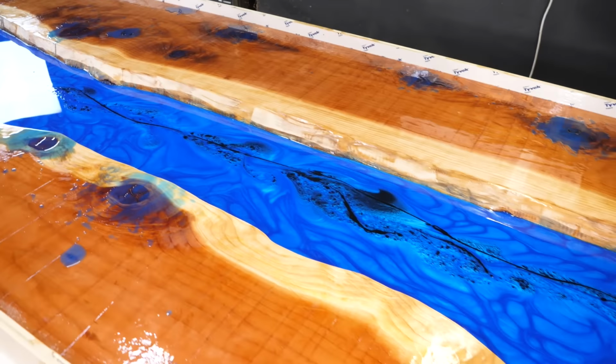And be sure to hit the rolled edges, top and bottom. That is a trouble area. If you miss that, you'll come back and it'll be a little bit different. Your eye will catch that. So make sure to hit the top and bottom rolled edge with the roller, and I do that as a final pass. We're going to let this Ultimate Top Coat cure overnight, and ooh la la, look at that, we're back.